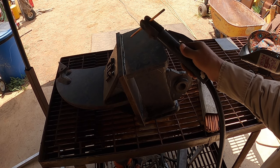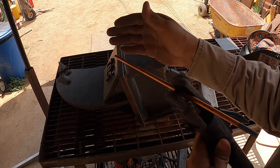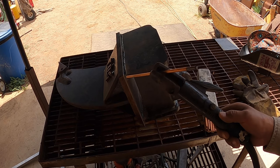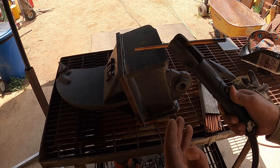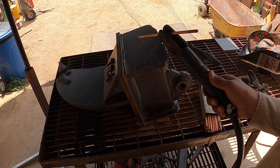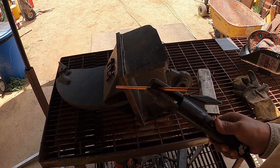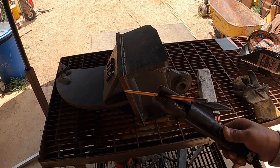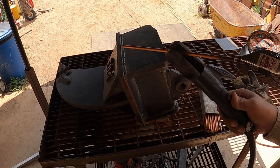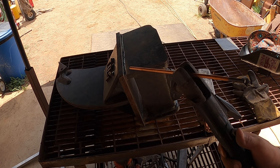It's just very sputtery. That's either too high of amperage or too slow a travel speed, as far as weaving or straight lines, that type of thing. So I like to back down the amperage first, and that way you get a nice steady arc, almost like welding. You have a steady arc with arc gouging. You don't want it sputtering too much. Sputtering, I would imagine, makes your machine work really hard. It's constant on off arcing, so that may not be good for it.